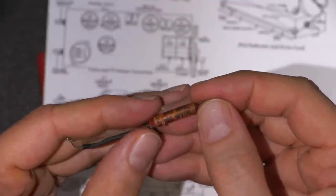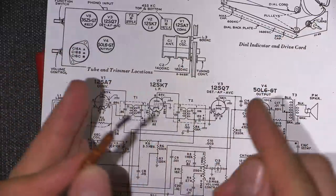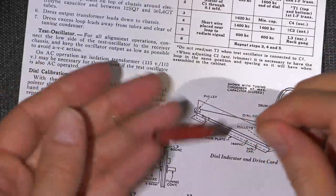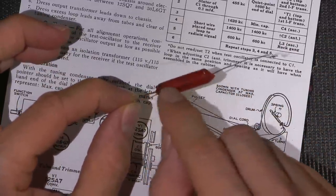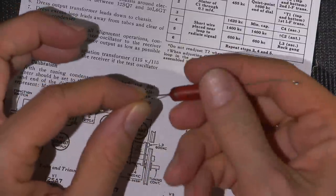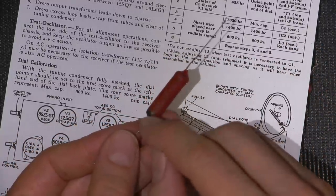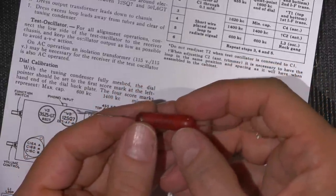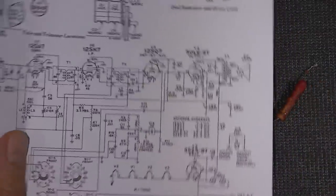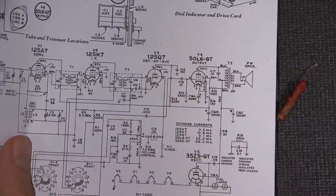And how important is shielding? Well, you saw it in that radio. RCA actually wound an entire pipe of wire and put it over top of this capacitor right here to shield it. Now, granted, that end is running to ground, the one end of that coily pipe is running to ground, but if this was used in bypass, this end of the capacitor would be attached to ground. So this would act as the same thing. It would be shielded to this point. Very important to install these the correct way for optimum results whenever you're working on anything that has vacuum tubes in it, or anything where you're dealing with a circuit that's got flying components like this, and this isn't sitting on some form of a ground plane.